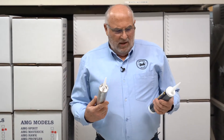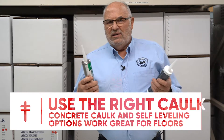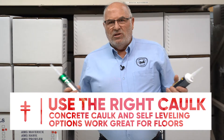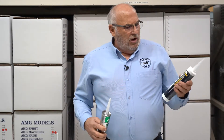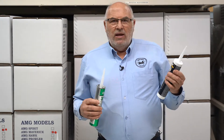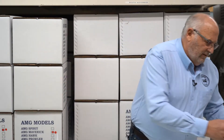There are two types of caulk for basement floors. This happens to be a polyurethane highly recommended concrete caulk. Make sure the caulk you're using is recommended for concrete floors — it needs to be durable, have good adhesive quality, and good expansion quality. This polyurethane concrete caulk is color coded. We also use the same version in a self-leveling or thinner mix, which comes in handy for thin saw cuts in newer construction and for smaller natural cracks. Both are very valuable.